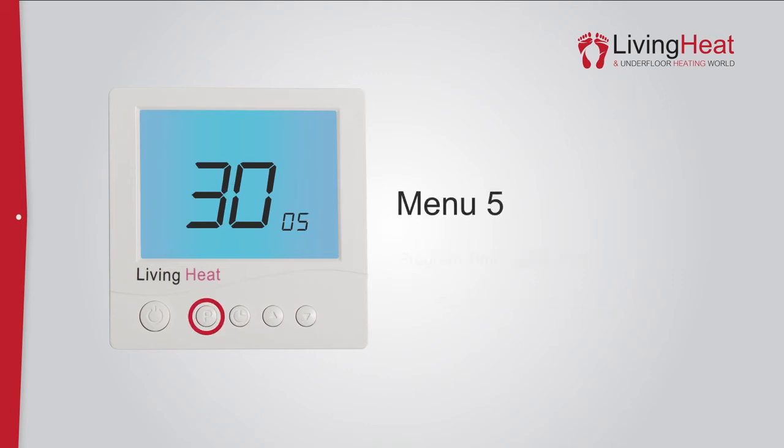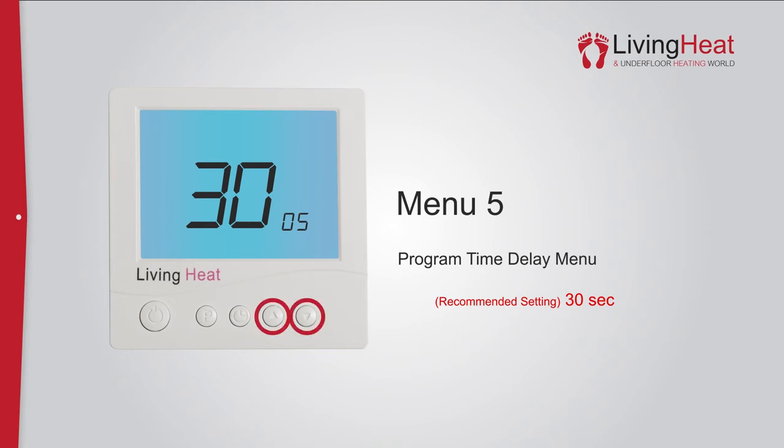Use the up and down arrows to select your desired setting and then press the P button to move on to menu 5. Menu 5 is program time delay. This is the amount of time the thermostat will stand idle before automatically returning to the home screen. It is helpful to set this to 30 seconds to allow the user more time to consider their settings when programming the unit. Otherwise, they may find the unit automatically returns to the home screen before they have a chance to confirm and save their settings.